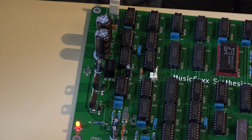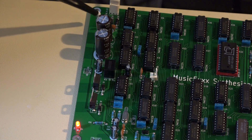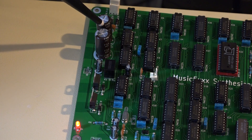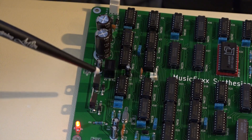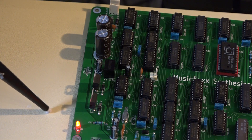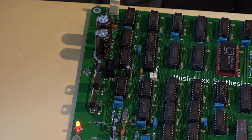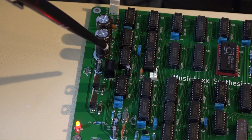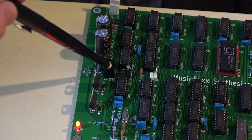As we take a look at this side of the PCB, this is the power supply section. This is 15 volts AC coming in, there's the rectification, smoothing capacitors, and the regulation circuit. These two ICs give you a plus and minus 15 volt rail which is used for the D-to-A converter, the op-amps that drive the audio output, and some other parts of the circuit. This regulator here gives us the 5 volt rail for all the logic on the circuit.